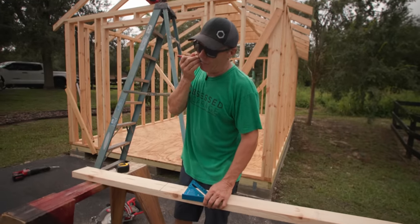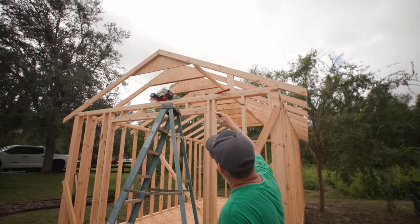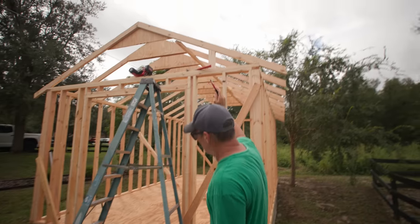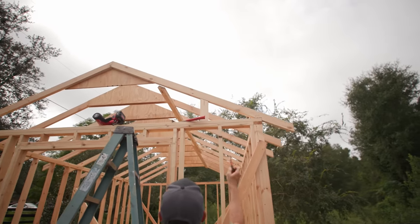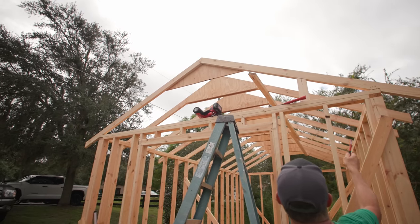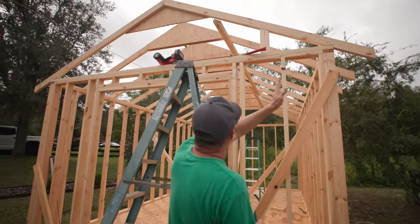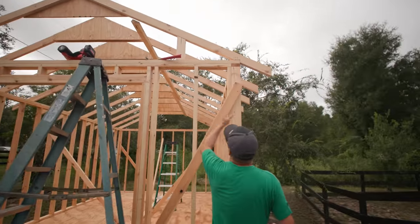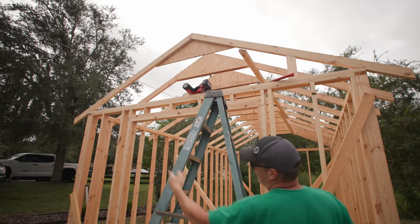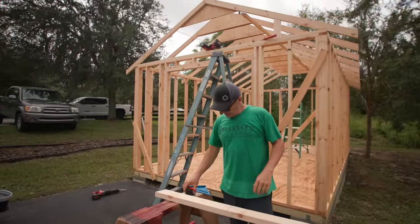All right, so the last truss, because this is going to get sheeted, what I have to do is put in some blocking to allow me to nail off the plywood. I'm doing this on 24 inch centers. Because the plywood's obviously 4 foot wide, there'll be one edge of plywood starts here, that's 2 foot, put another one, a center line at 4 foot, and so on. That way every time I hang a sheet, I'll have something to nail to. So that's what I'm doing.